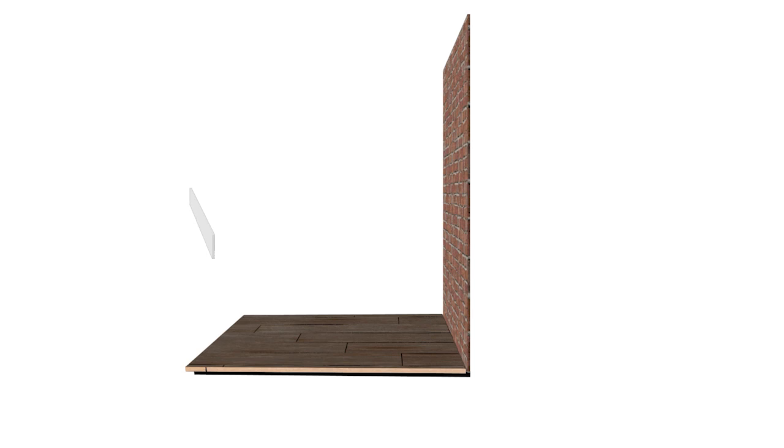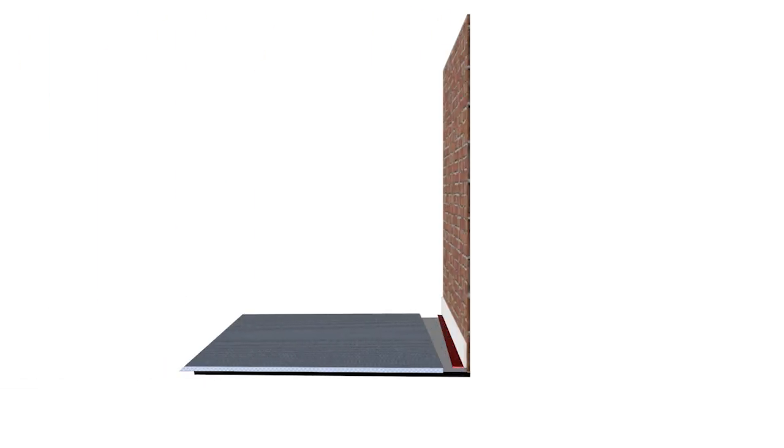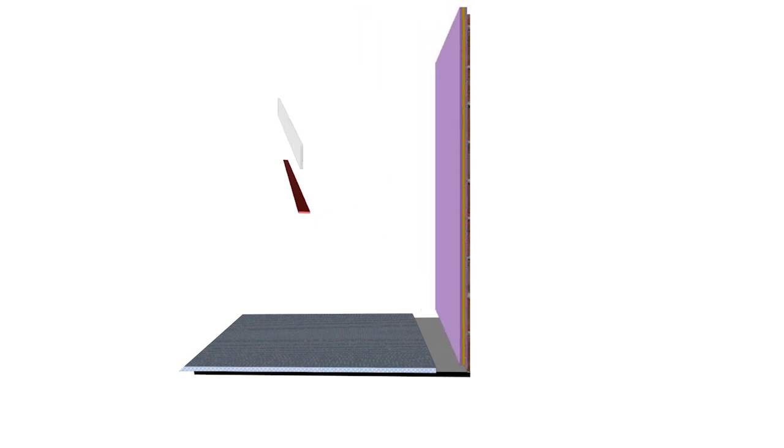For your flooring, a hardwood floor remains in place. Floor coverings such as carpet and linoleum need to be rolled back — remove the carpet gripper strip from the floor as this will be in the way of your new system. When your wall is finished you'll be able to cut the carpet or linoleum to size and refit it. Don't install your system over the top of carpet because you'll have a weak area of low mass that sound can escape through, and it also makes changing your floor covering problematic in the future.